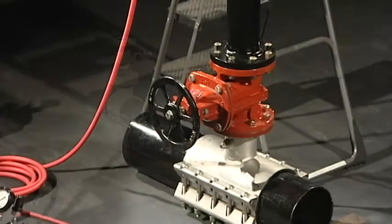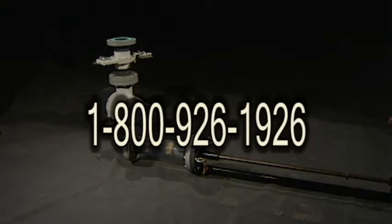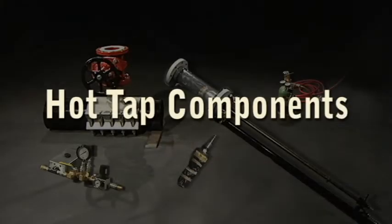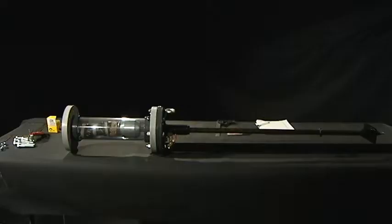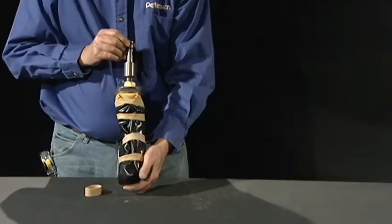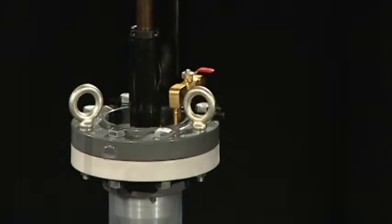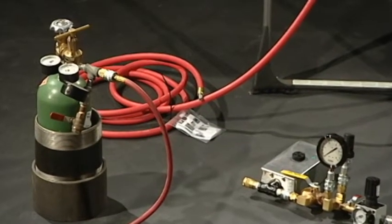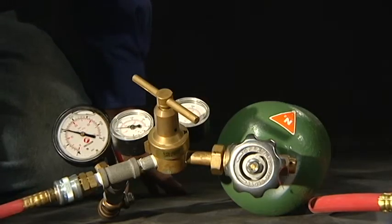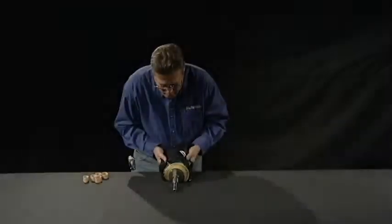The insertion may be made from above, below, or on the side of the pipeline. Many hot tap insertion system variations are possible — call Peterson to discuss your specific project. The components of the hot tap insertion system include the tapping saddle, a full port valve, a launch cylinder, the multi-flex pipe plug, an inflation ram assembly with a centering guide, stop collar, ram packing seal, and an inflation ram anchor system.